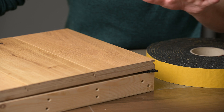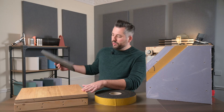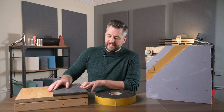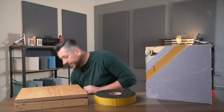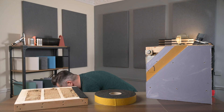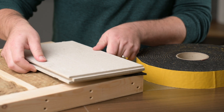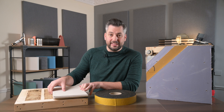That on its own isn't going to solve all the problem. You then want to further upgrade by adding a soundproofing solution on top of your floorboards, such as our Soundmat 3 Plus in this example. Alternatively, you can replace your floorboards with a higher mass option, such as our SoundScreen 25, which sits directly on top and adds a lot more mass than a standard floorboard.